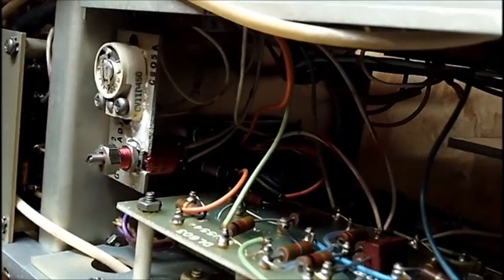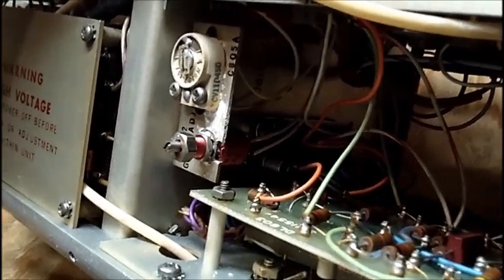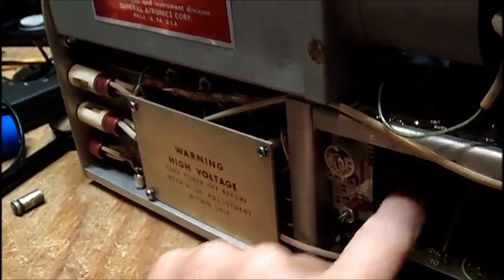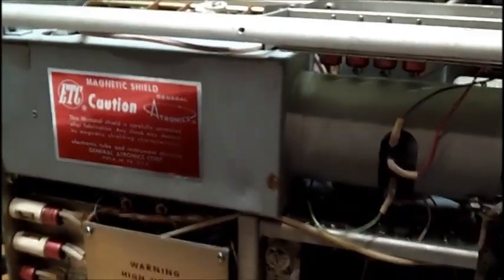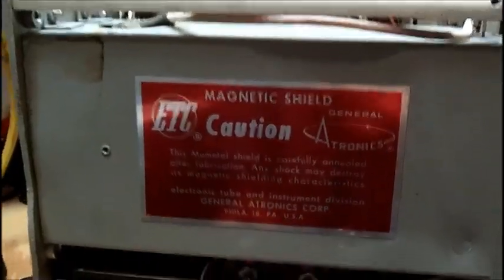The reason I wanted to get this out is to make sure the contacts are clean — it could be corroded. The plug-in connector is down in there; it's a blue connector. I shot some DeoxIT down in there. I had a lot of corrosion — even on one of the pins there was white stuff just sitting there. It disappeared when I sprayed it with DeoxIT, so there's a lot of corrosion in this scope.